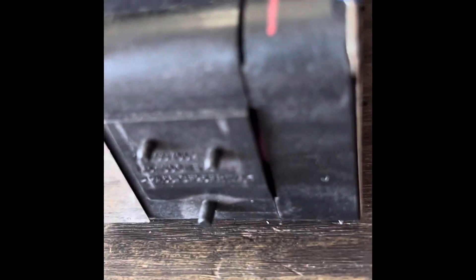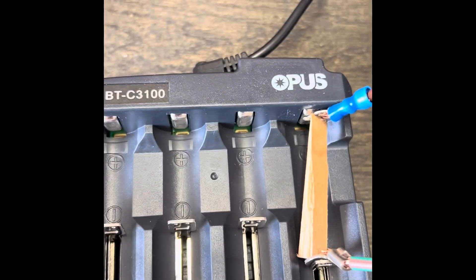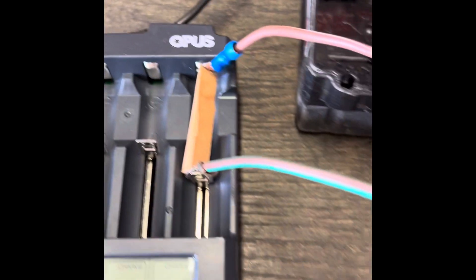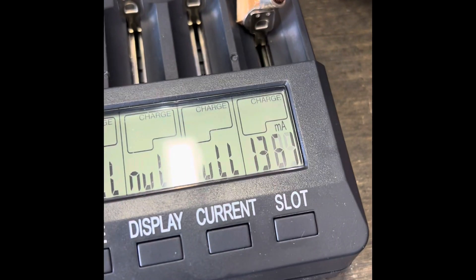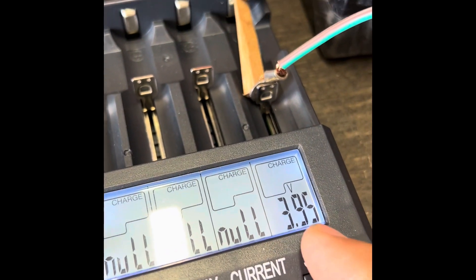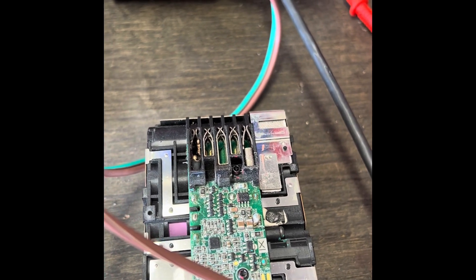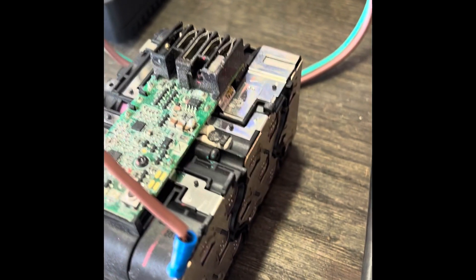I made up some whips — some leads — and stuffed them in there. I didn't think of this myself, I saw it on another video. You need this model of the Opus battery charger. Put a wedge in there, then set it to as high a voltage as you can pump into it. What you're trying to do is equalize — trying to bring the weak group from 2.9 up to 4.08. I'm up to 3.95 but I don't know if I'll get there.